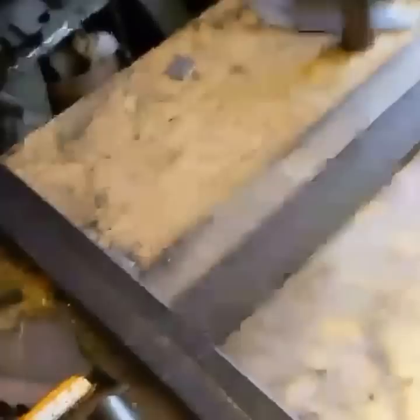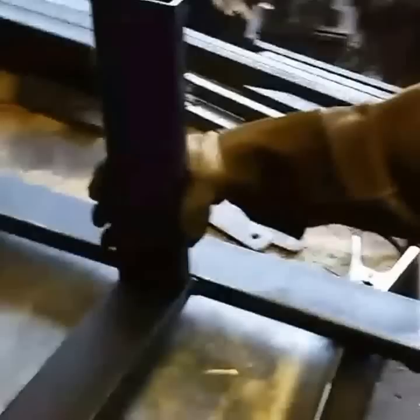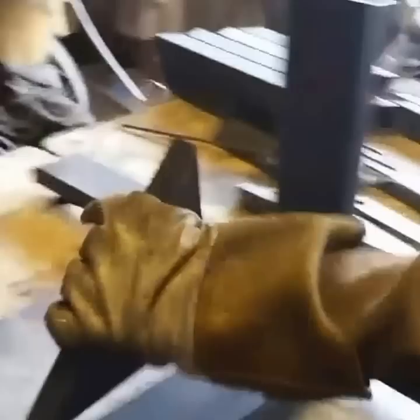So now we'll just add these feet before we flip this thing over and finish it up. First we're going to need these uprights and they go right here like that — tack them in place. Next, we're going to weld these lateral braces right in place like this. Center them up and tack them firm. There's plenty of room to get in there and weld all that off.